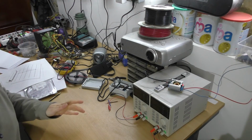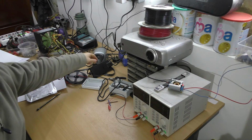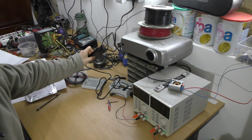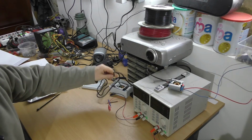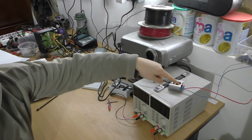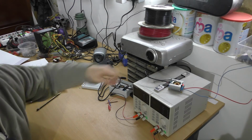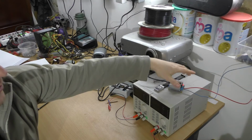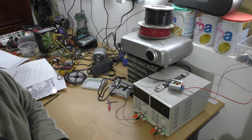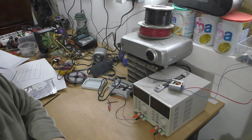The system I'm going to use for my workshop is actually very similar to the lighting that's being used for this video. What I've got here is an old laptop power supply. This provides 19.5 volts, and I'm running that through here to this, which is a buck converter, and then that's going off to 2.5 metre strips of LEDs that are illuminating this scene. I've got this set to 12.5 volts at the minute because I'm just soak testing the LEDs, to make sure they are more than happy with 12.5 volts, and they seem to be. I've actually run them higher. I've run them at 13 volts, and they seem happy with that as well.